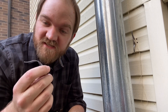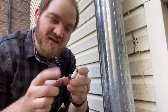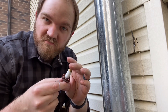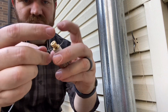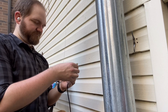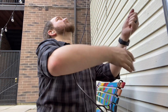For testing purposes, I'm going to use the same spark plug 64-to-1 unun that I demoed a few weeks back. Long term, I'd like to use something with a little bit more power handling capability and a slightly more rugged form factor, but again, this is just a quick test for today, and this is going to do just fine. I'll strip off a bit of the insulation here and wrap it around the nut on the end of the spark plug antenna. Don't forget to plug in the coax before hoisting it into the air, then loosely tie the twine around the toroid just as a support point, and haul one end of the antenna into the air.